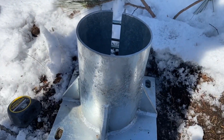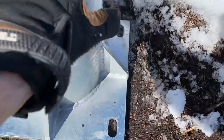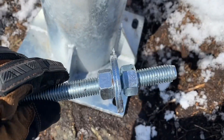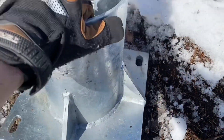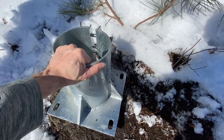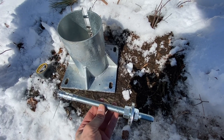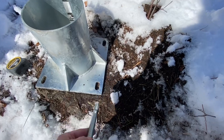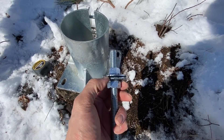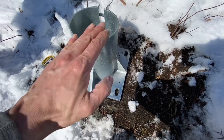Depending on the camera angle it might be hard to see, but we have some elevation difference in the base plate, so we want to make sure that this is level. Based on the elevation difference, we take that into consideration to ensure we have enough thread. You take your lowest corner, level off the base plate, and measure that height. In this case we have two inches, so given a 10-inch wedge anchor, that still leaves three inches of thread — plenty to make small adjustments and lock it down because we're using a double washer and double nut application, so the plate sits in between the two washers and allows us to adjust it up and down to get it perfectly level.